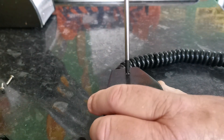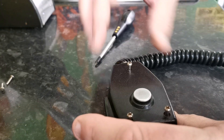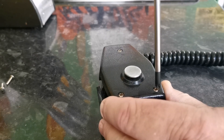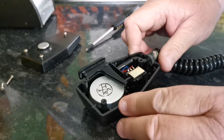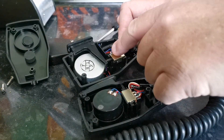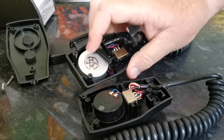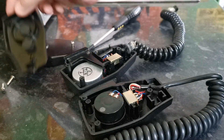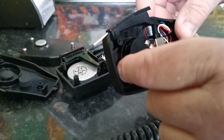But don't knock the coffin microphones because they work amazingly well. Three screws on the back — get the old screwdriver in there. There we go, release those. Now we can see inside — it's very similar. But as you'll notice, the PTT switches are 90 degrees angle to each other, so that will require some slight modification. Also to note, the actual dynamic part here is a lot larger than the other one. Hence why we're going to have to cut away some of this surround to allow it to fit in.